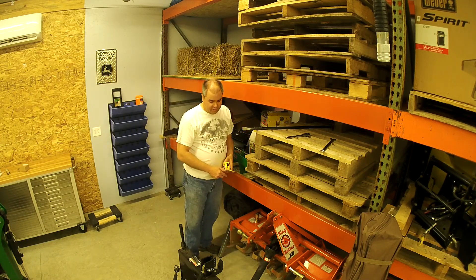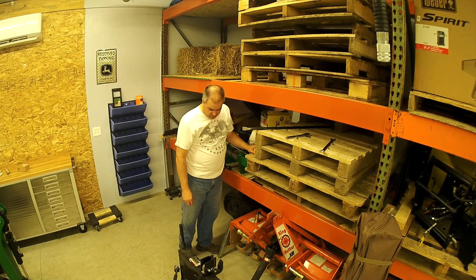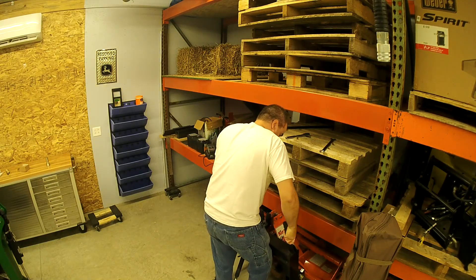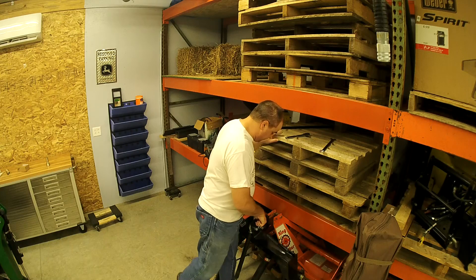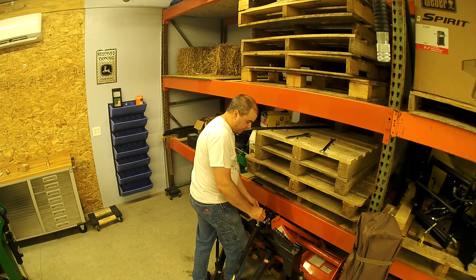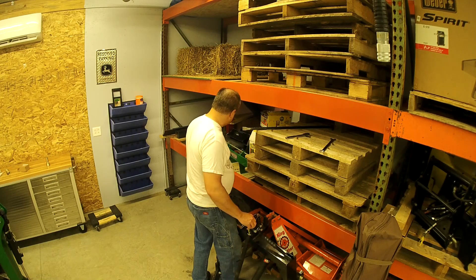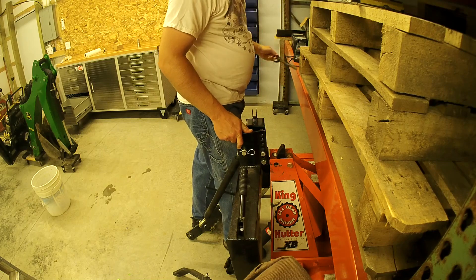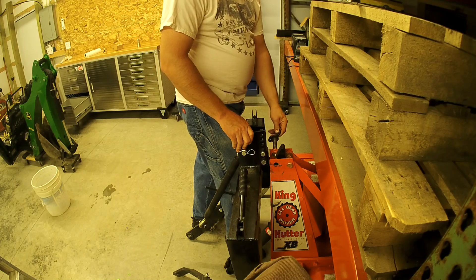Christie's outside mowing with Johnny right now, so I'll lift the quick hitch up and show you the other problem. The quick hitch is not even too hard to attach by hand. So the second problem is a little more severe — I can't get this pin in because this piece is too thick. You can see that it just doesn't line up. This piece is entirely too thick to allow that to connect.